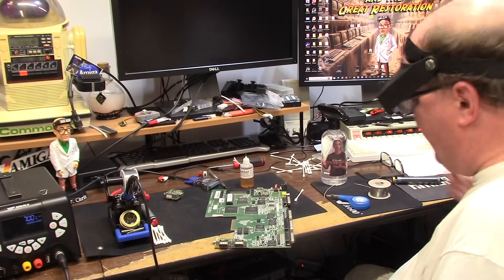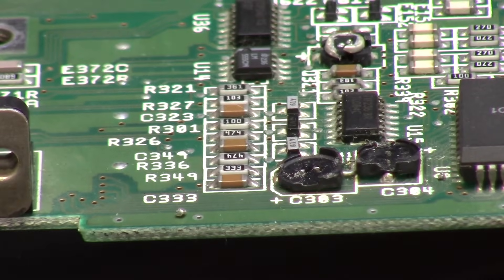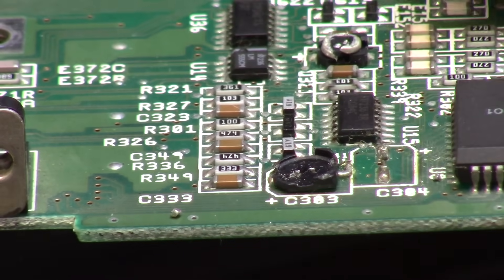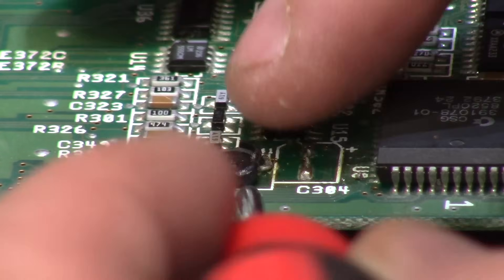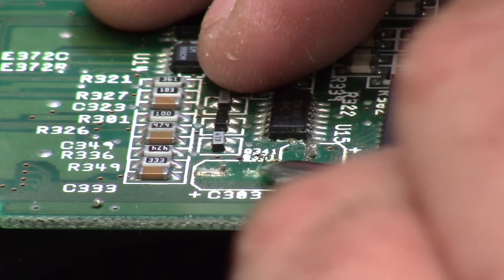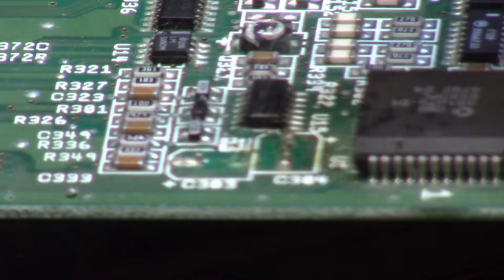I'm telling you these are recapped but they're old recaps. So I cut these two caps here and this top one. But look at this — do you see this wire? This wire is going to this leg because I guarantee there's no pad there. They bodge-wired a negative pad, just laying on top of this hole. We'll take that and throw it out. Let's clean the area before I alcohol it off just to see what's going on.